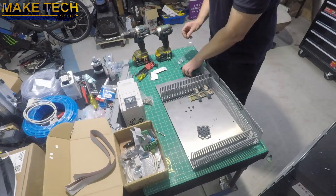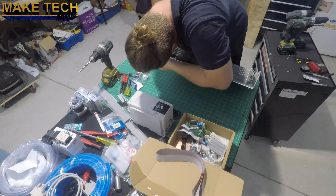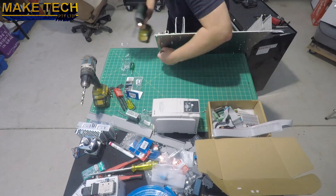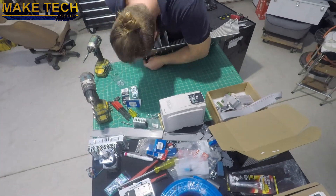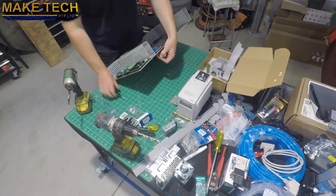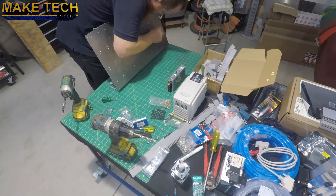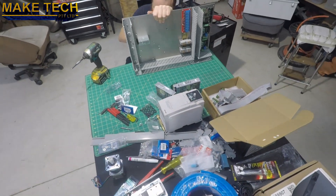It's a good idea to have spares and room for additional functionality in future. With that in mind, I've left room for a second 8-channel relay board and an Arduino Mega or similar-sized microcontroller. I've already got two breakout boards — one will be used straight away and the second is a spare. In future, if I need additional functionality and haven't used them as spares, I've got a second 8-channel relay board and breakout board which may be used for something like a robot or some sort of automation, and I won't have to change the whole layout of the electrical enclosure.